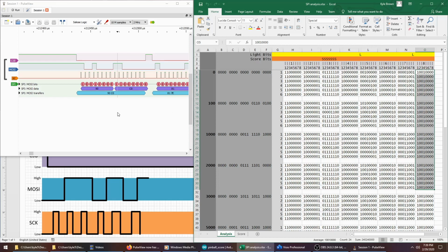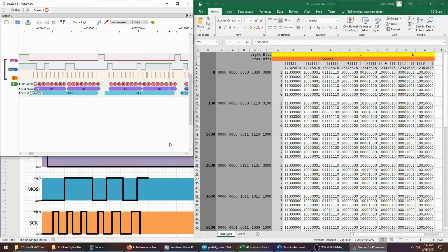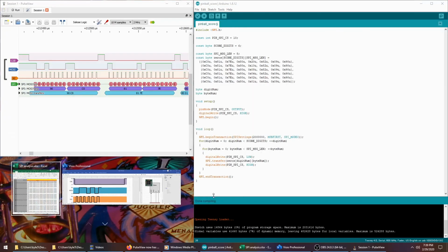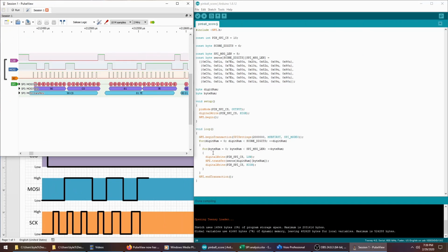And also in my program, I was not setting the chip select right. So eventually I did try activating the slave, sending a byte, and then deactivating the slave, so 1 byte at a time. But I never tried sending 2 bytes at a time. So I'll have to change these loops to send 2 bytes in between the chip select toggling.